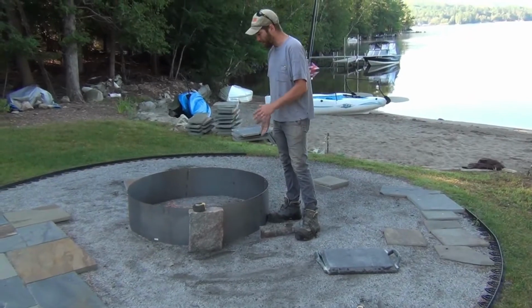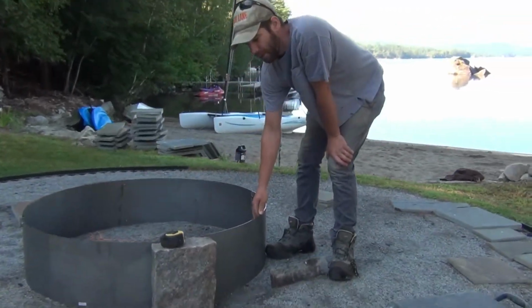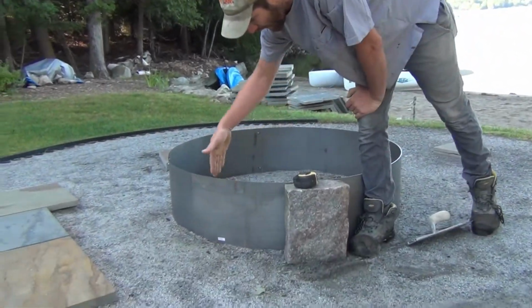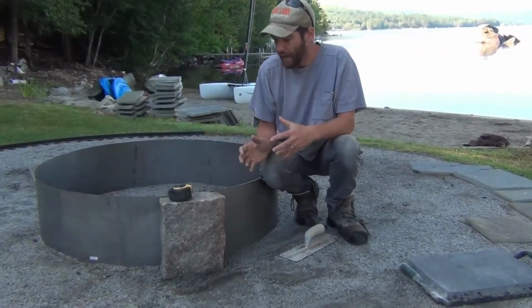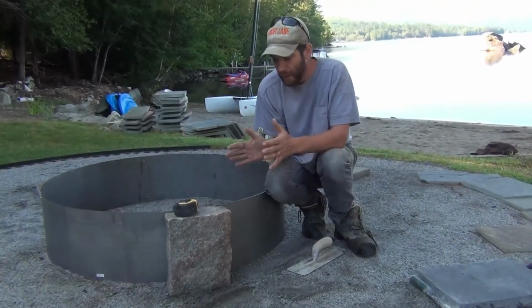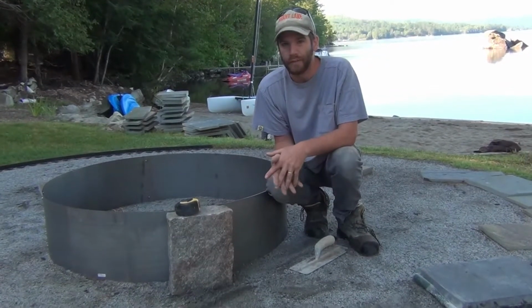So what we're doing here is a metal ring. I'll show you where you can source those down in the link below. And we're going to do a soldier course of granite around the outside. The metal ring is going to absorb most of the heat of the fire and keep things contained and keep that thing from just burning the rocks up. And it's going to allow us to do a much narrower profile. So we'll go through the stages here coming up.